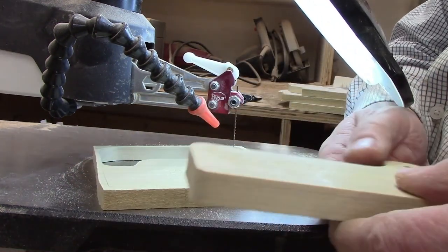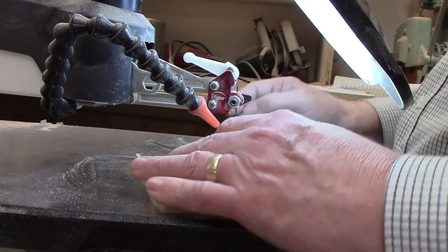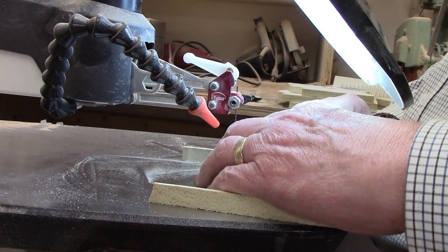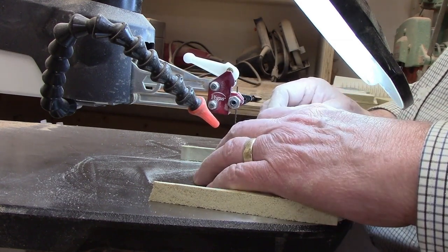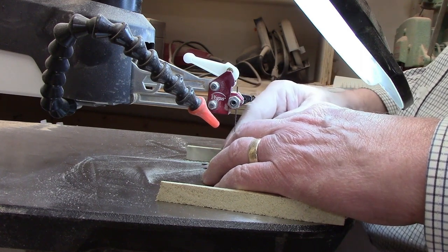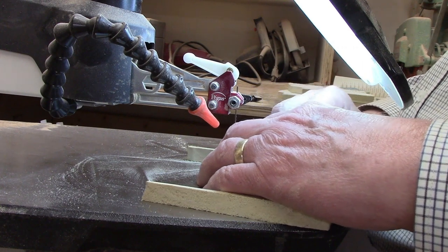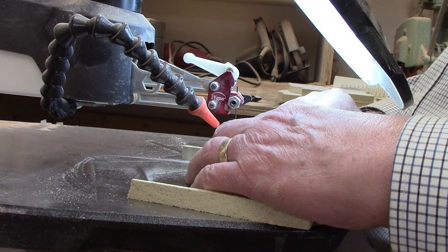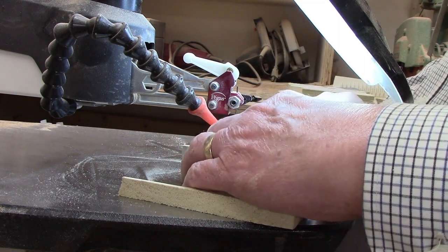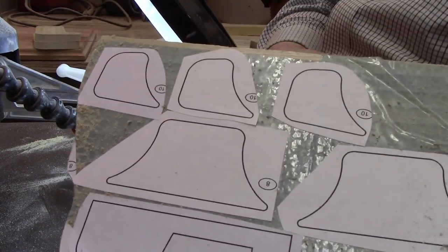There's a little bit of a rough spot that's going to need some sanding, but not much. This is a good project for a beginning scroll saw user — there are no inside cuts at all, and the outside cuts are fairly gentle curves. I have a foot switch with this machine so I can turn the blade on and off as needed. If the blade pings, that tells you the tension is right. If it's too loose you can't track properly; if it's too tight, the blade will break too quickly. Actually, if properly tensioned and used, the blade shouldn't break at all — if it gets dull, replace it before it breaks.